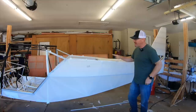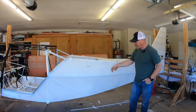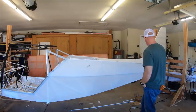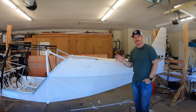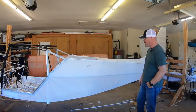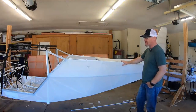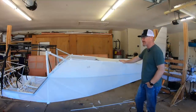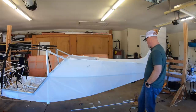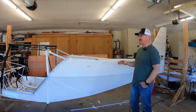All right guys, so the final heat treat has been done on the fabric, nice and tight, 350 degrees on all the surfaces. So it's time to bust out the poly brush, the mask, and a paintbrush, and start soaking this in with the poly brush to lock the fibers. Then we can start thinking about doing the tapes, which I think is a pretty extensive project in itself.